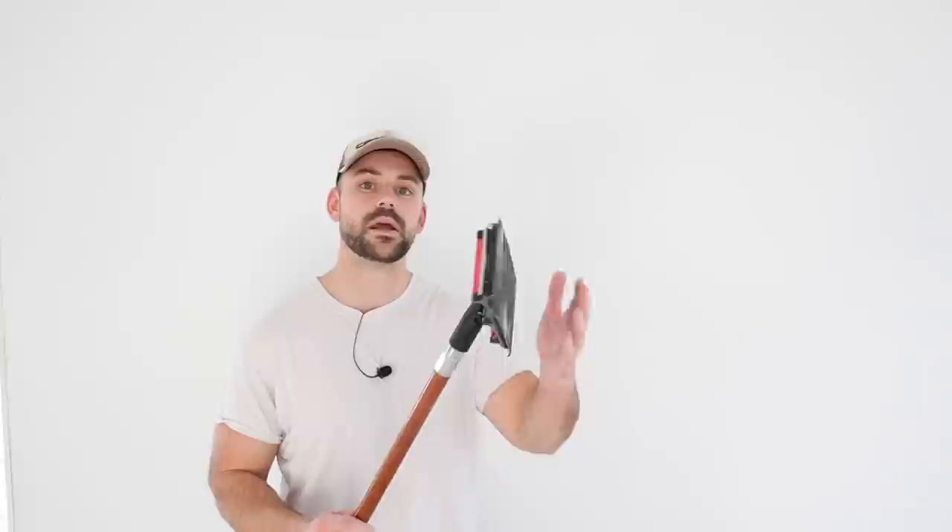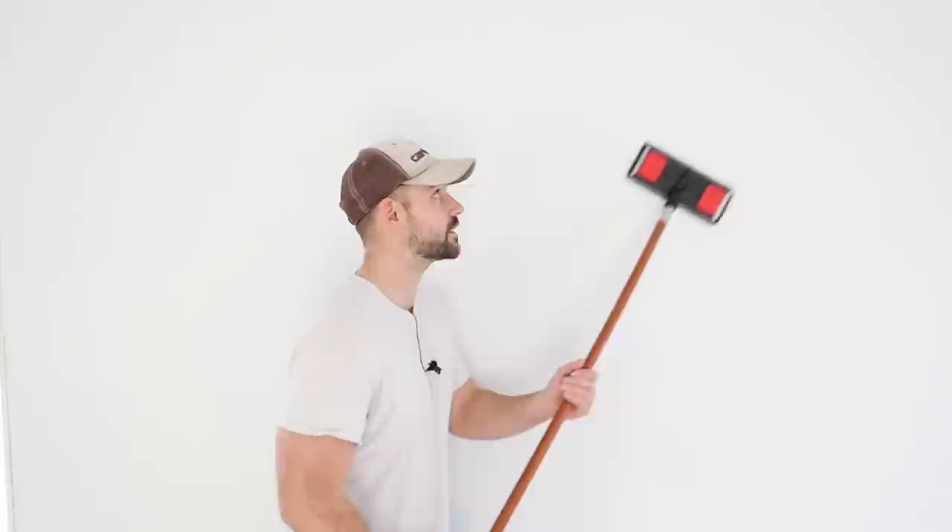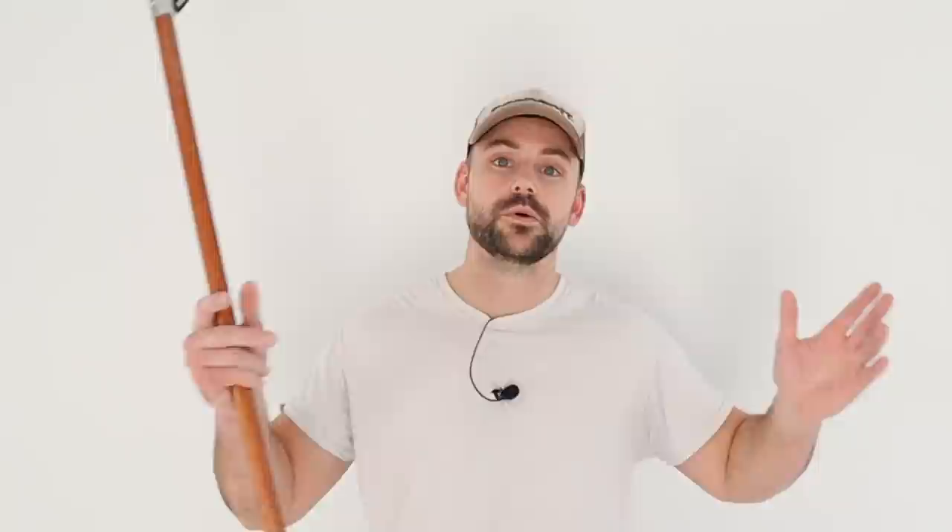The room now has one fresh coat of primer. Let it dry — after a few hours the walls look more solid white rather than blotchy, because latex dries more solid. Now I've got a sanding pole with 180-grit sandpaper and I'll go over the walls and ceilings lightly. This knocks off any clumps of drywall dust or raised paper on the drywall. It's really important to sand between coats of paint and primer. We'll do a second coat of primer as well — just like the first.